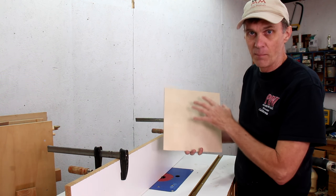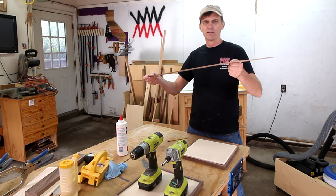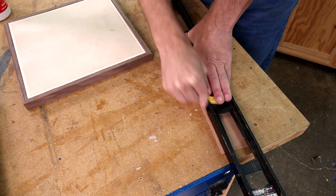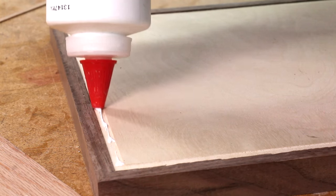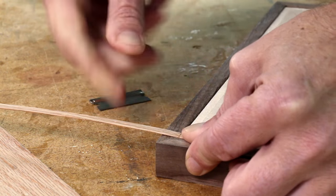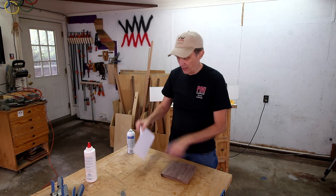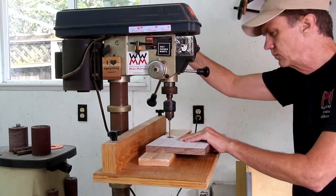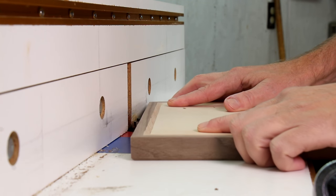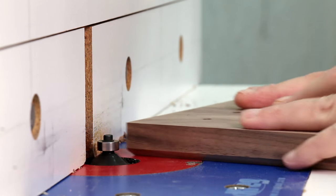I want to add an oak inlay around the top of the box. To do that I'm going to make a real shallow rabbet all the way around the edges. I'll cut strips out of this real thin piece of oak that I cut for some other project — it's so thin I should be able to cut it with a razor blade. I glued together three boards to make up the game board and I drew out a template to help me drill the holes equally. This chamfer around the lid makes it a little easier to open the box, and the chamfer around the game board just adds a decorative touch.